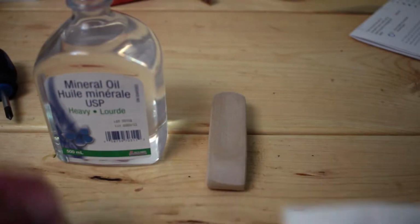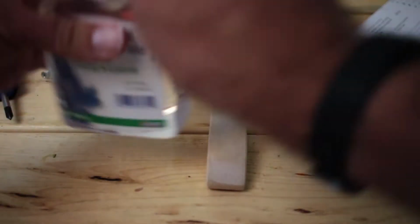The awesome thing about the wood filament is you can treat it pretty much like regular wood. It doesn't absorb stain quite as well as we showed in a previous video with the shift knob, but give it a nice sanding to smooth it out really well. We started with 220 and then gave it a quick hit with 400 just to make it a little bit smoother.